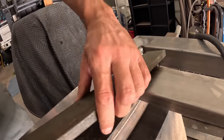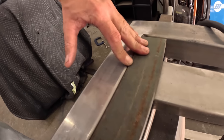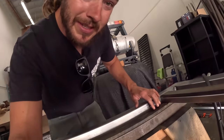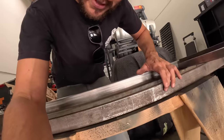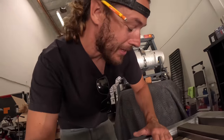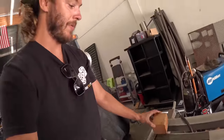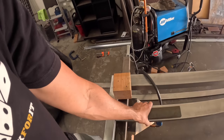I'm going to use that flat bar to rest our one-by-three on top of. We put another piece of flat bar on top and we are flushed out right there, which means we are dead center. This is going to be our spacer sitting on top of the tube we're using to hold everything up while welding. We already pre-cut all of our four-by-four spacers that are going to give us this dimension.